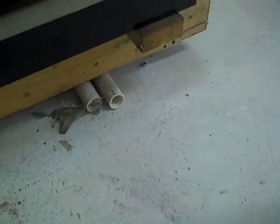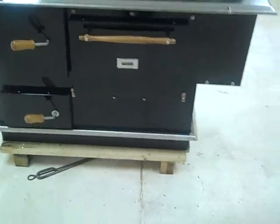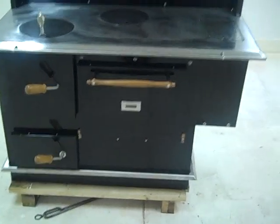This one also has a water reservoir on the side — five gallons — so it's got nice hot water. To get that water out there's a spigot. We're going to elbow out with stainless steel and put a nice brass spigot on here, so you can put your pan on the floor and fill it up with five gallons of hot water. That's a nice feature without any pumps, without any electricity.